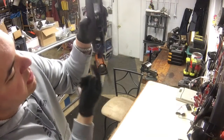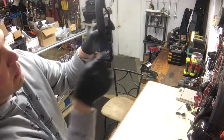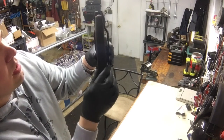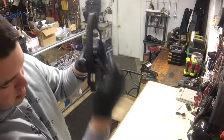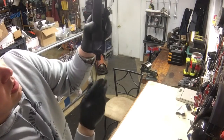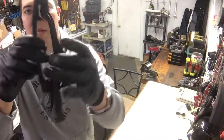To remove it, just loosen the allen wrench — don't throw it around — loosen it up, take your black cap off, and then your handle will slide out like this. Put your handle back in; when putting the new handle back in, slide it forward. Put your black cap back on and then retighten that screw until it seats on that black cap and you're good to go. Then the door handle will work like it's supposed to.